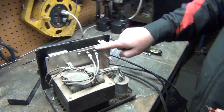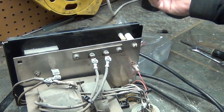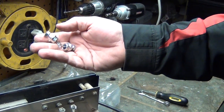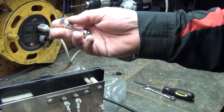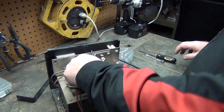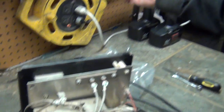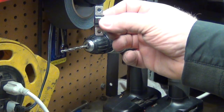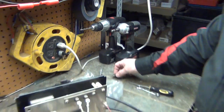EasyGo does not make this board anymore. If the diode's bad, you've got to replace them both — the part number is 18488G1, and you'll need to replace them both. The fuse number for that 50 amp fuse is 28106G01.